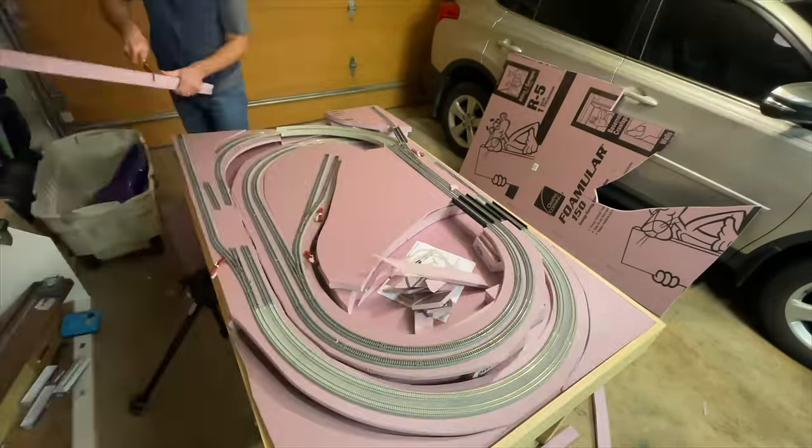I soldered wires to the back of each button, and then temporarily installed each button in the layout frame. I then hooked up two wires to each of the DS64 units I'm using to control the turnouts that will eventually connect to the DCC bus line that powers the track. I attached these with some double-sided tape to the bottom of the layout for now, and later will permanently install them with some screws once I am ready to actually wire all the turnouts.